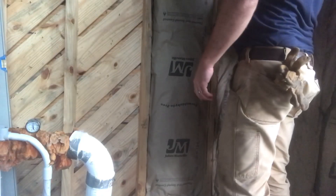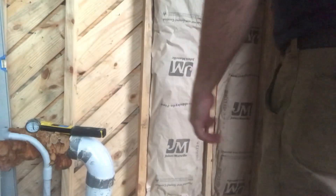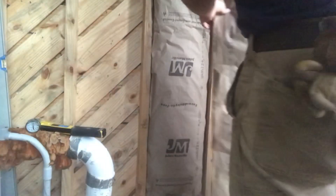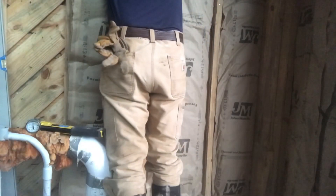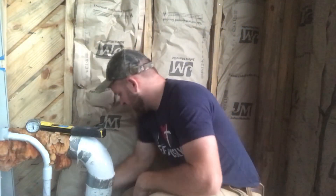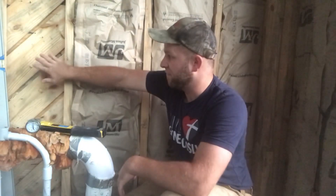You've probably seen it before - this stuff goes up super fast and easy. I was spending more time just shoving stuff out of my way trying to clear space. I do still have two more rows of siding I need to put up on the outside on the north wall, so I don't want to put any insulation up there just yet because I don't want blowing rain to get in underneath and get the fiberglass wet. I'll put these last few pieces up here - this one and this one - and that's it for the east wall.